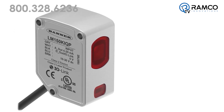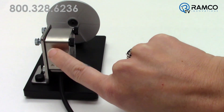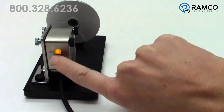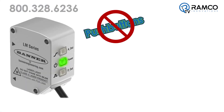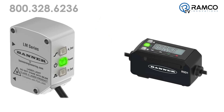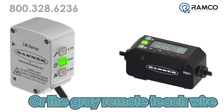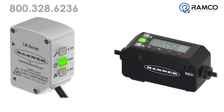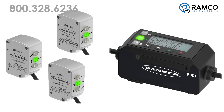Other features include IP67 and grade 316 stainless steel, thermally stable housing, and secure mounting to ensure accuracy. Because of the high accuracy of this sensor, undesired error can be introduced by simply pressing down on a button when teaching setpoints. For this reason, no push buttons are available on the sensor itself. But the sensor can be programmed via the optional remote sensor display, RSD, or the gray remote teach wire. The RSD can be used to program and backup parameters and can then be removed when complete. This is an advantage over other sensors because one RSD can be used with multiple LM sensors.